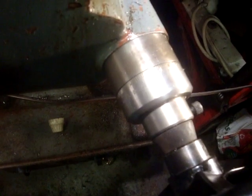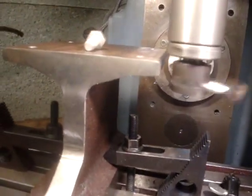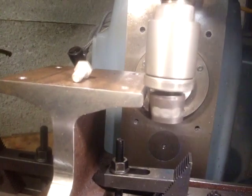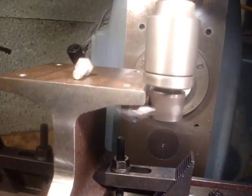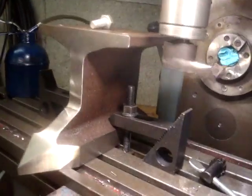Like I say, it's hard to do it one-handed. Up to 35 there. Start winding the cutter in there. And what I do, I look for that thing there that's to do with the stop. Then I engage the automatic feed. That starts cutting. Cuts out, I grab the handle, push it away, like that.